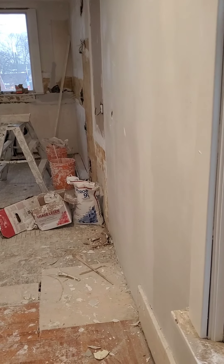Tomorrow I'll probably pre-sand that and then give it one more load-up coat just to overbuild it a little bit more so it will skim flush with the rest of the wall. Once I skim that, this area is all getting covered. I put a coat on that just to kind of straighten it out — I'll throw one more coat on there to get it true flat. These butt joints just have one coat on them, so tomorrow I can load the flats right across them — they'll be nice and dry and will build out beautifully.